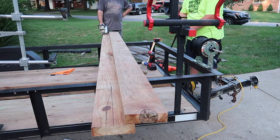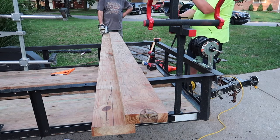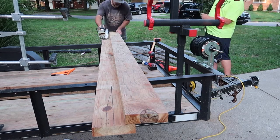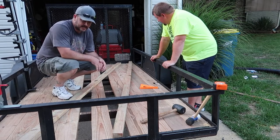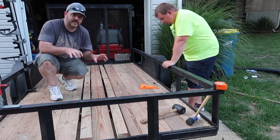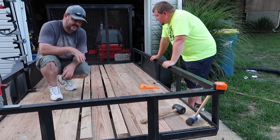These new two by sixes are a little bit wider than the old composite boards. So what we're going to do is cut a design where we have two narrower pieces on the outside of the middle board just to get it to fit properly so the bolt holes are actually lining up down the middle. We've ripped down one two by six which gives us two and three-quarter inches to put in between. There's a little bit of gap on each side but this is a lot easier than ripping two boards down to the exact width. We just went ahead and ripped one two by six down in half — structurally there's nothing wrong with this.